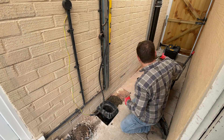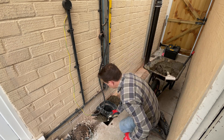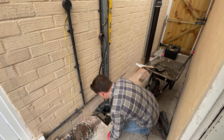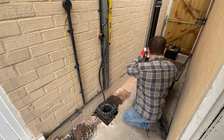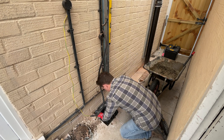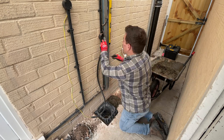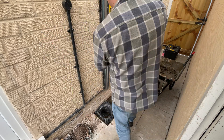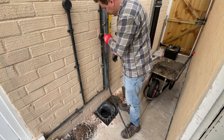The keen-eyed among you will notice that at the far end there's some sand. When I removed the slabs and broke through finding the existing concrete pad, I discovered a manhole underneath roughly where the wheelbarrow is — it kinda makes sense now with the soil pipe right there. The battery won't be sitting on the sand, but I do want a nice rectangular concrete pad. If I ever need to access the inspection chamber in the future, I can remove the slab and the sand which will then allow the cover to be lifted. I kinda regret not looking down there earlier.